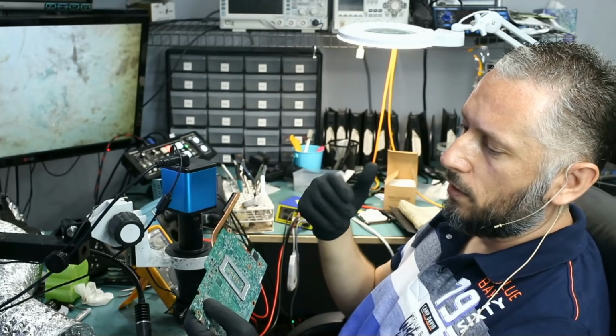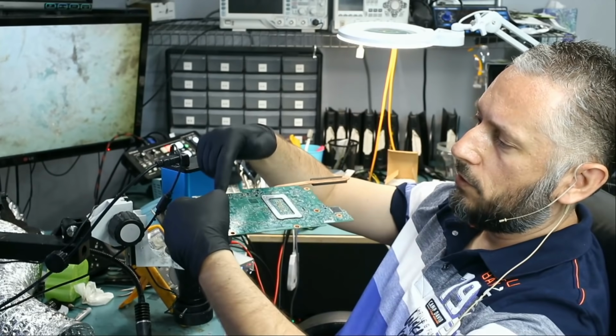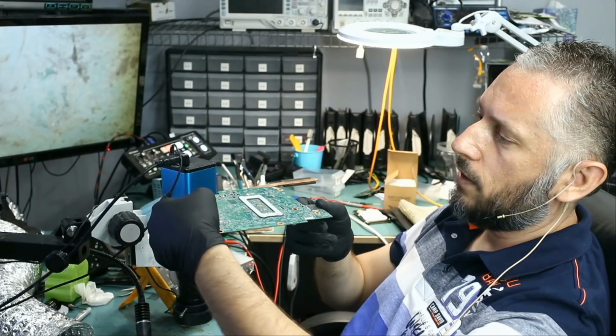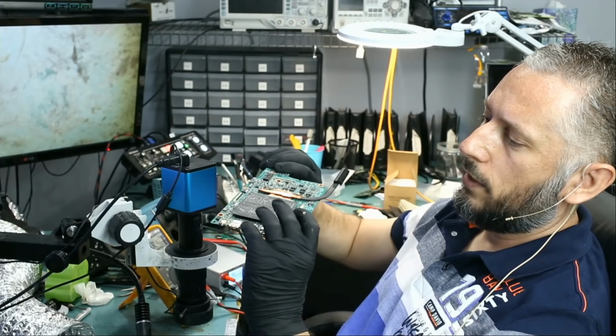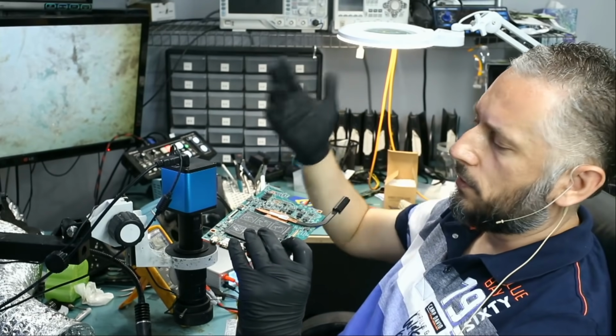Some even asked, can we use alcohol to find out where the short is coming from? If you are injecting voltage here, how can you put alcohol on this side of the board? Unless you can find a common point where you can inject voltage here and then drop alcohol on the whole board and see what evaporates first.